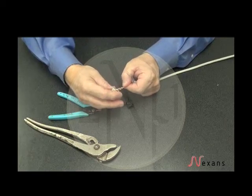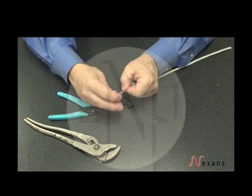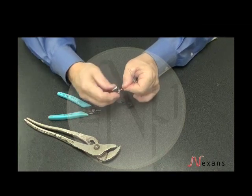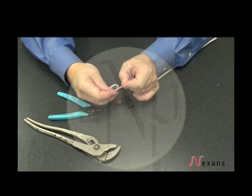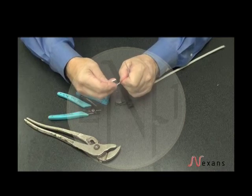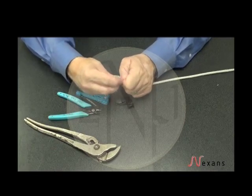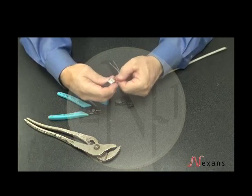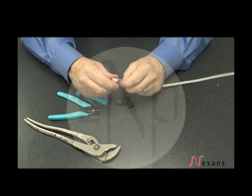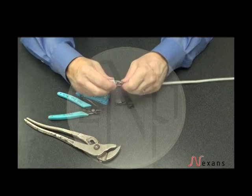Load the lower level first — brown and orange. Solid is on the inside, stripes are on the outside. Once all four pairs are loaded, carefully slide back against the jacket.